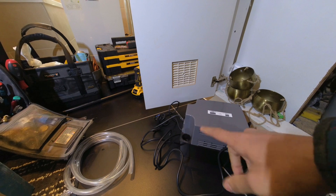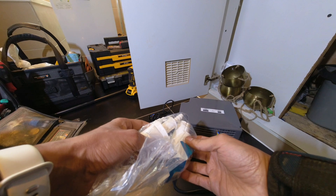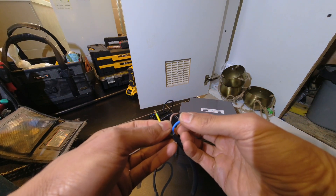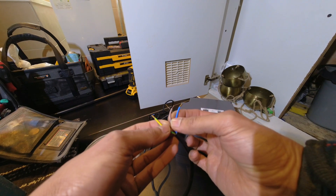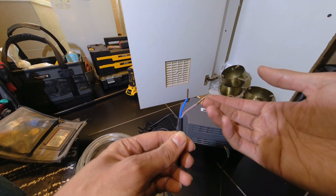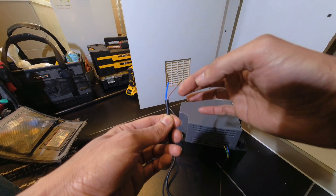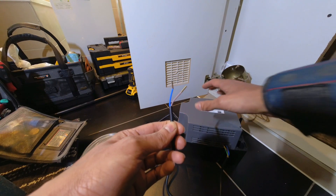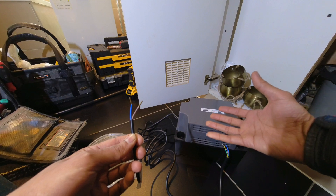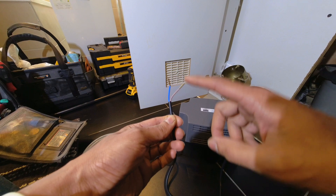Once you've got your condensate pump unboxed, you're going to find the pump itself, some condensate tubing, and a few different attachments depending on how you're terminating the condensate tube. The main thing to look for is you're going to have two cables. The first one is your mains cable — live, earth, and neutral — that's just going to be wired straight into the fuse spur or you can tee off the connection inside the boiler. The second cable is very important — you could call it your high-limit stat cable. If the condensate pump ever fails and stops pumping water out, this will break and stop the boiler from running, stopping it from continuing to condense. Otherwise the boiler will keep condensing and instead of being able to pump the condensate out, it's going to overflow everywhere and cause further damage. So this cable is very important to wire in properly.